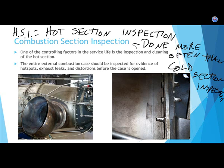I'm digressing. So turbine engine oil. My apologies. Turbine engine oil. John says that zero amount of the oil gets thrown into the combustion section and scraped off and pushed back down into the oil. Does anybody agree with him? Have you had engine oil systems for turbines yet? No one wants to say, okay, that's all right, I don't mind. All right, John is correct in that in theory, oil in a turbine engine never gets inside anywhere the fuel's getting burned, or anywhere the air is. Never. Unless there's a seal failure or something. In theory, none of that oil ever gets into the combustion section.